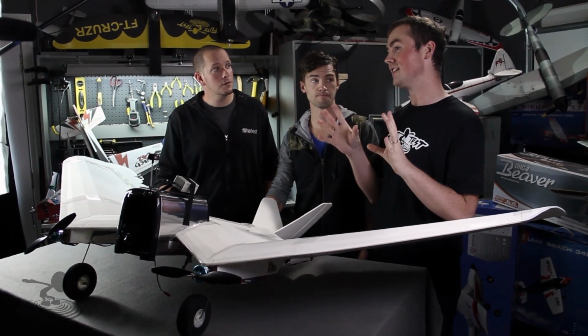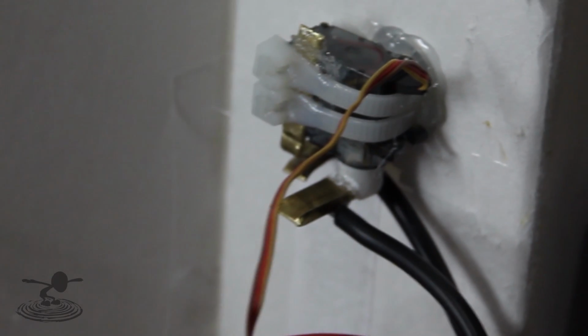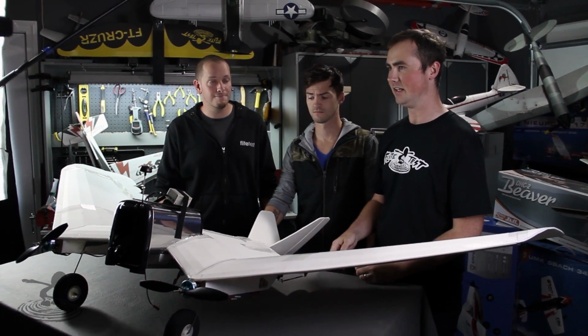So what I did was, I took the heating elements and I cut it into 4 parts. So I hooked that to a 6-cell LiPo. That's a lot of cells, and we don't really have that many 6 cells that are sizable. Yeah, so we used 2 3-cell 2200s in series. Yes. And I built a little switch for it out of a servo and some brass tubing. Electromechanical switch? Yes. Because it's a servo that has these brass fittings and it comes down. Because it draws 30 amps, so that's roughly 700 watts of toasting power, you can't have a solid state switch do that easily. Yeah, you can, but we just didn't have any, and I needed to get it done.